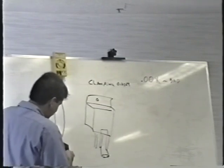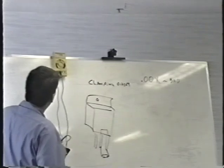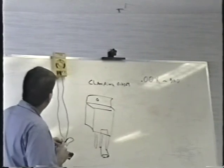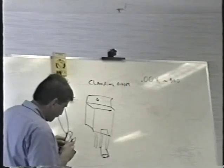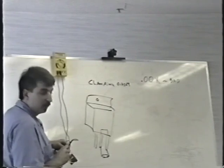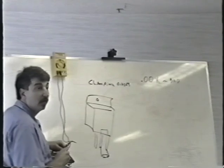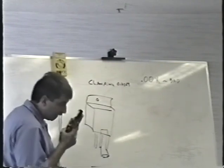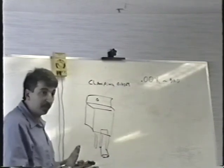And I go right across the plus 12 volt diodes, and the meter says 0.196. Those are okay. I don't have to bother going both directions because I'll get the same both ways. Let's check the minus 5 volt diodes. Holy bejesus, 0.000. Right across that, and across the other one as well, 0.000. So that's what's wrong with this one. Total time to diagnose it, look at the fuse, bam, bam, way less than 1 minute. And that's my problem.